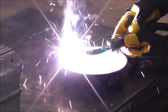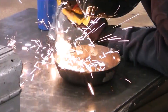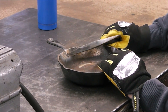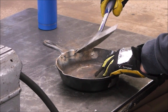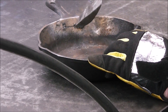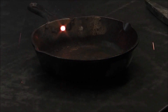If you guys have been following along with this cast iron welding series, you'll know that what I'm trying to do right now is limit the amount of heat input that I'm putting into this cast iron — and that helps to prevent it from cracking. To do that, I'll weld just a little bit, very short runs, half an inch or so, and then I'll peen it. Then I'll weld a little bit more, then I'll peen it again. By peening it — hitting it with that chipping hammer — it helps to remove some of the stresses that are within that weld as it's cooling down. You could also use a needle scaler that's usually air powered, but a chipping hammer seems to work just fine.